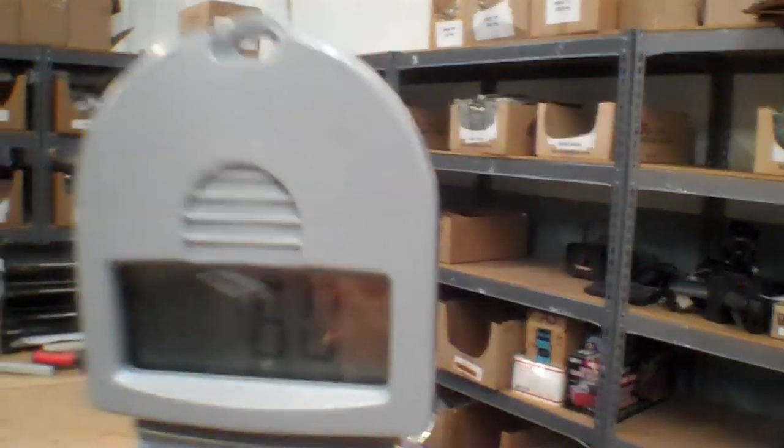We're going to fire this up. I want to see how loud it is and how long it takes to get down to maximum vacuum and see what that number is. Brian, you brought a measuring device with you today. Yeah, this is our TM90 — it's a Pirani gauge. It basically goes down from atmosphere 760 torr all the way down to about 1 millitorr. It's a very useful gauge, mostly for field service people, not something you'd leave hooked up, but always good to confirm that you have good pressure on the vacuum pump before going through your vacuum system to check for leaks. It's always good to have a starting point.